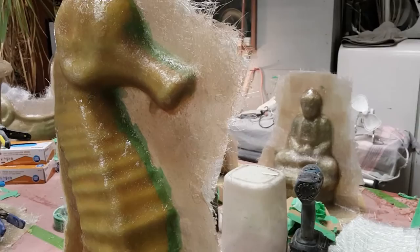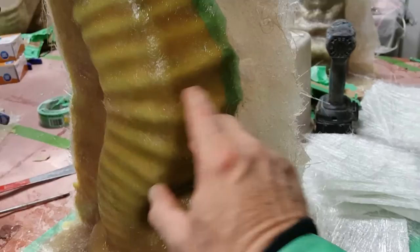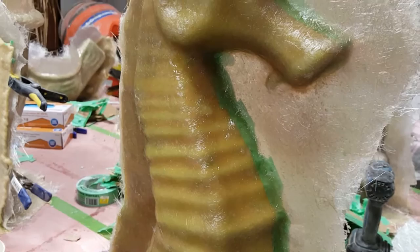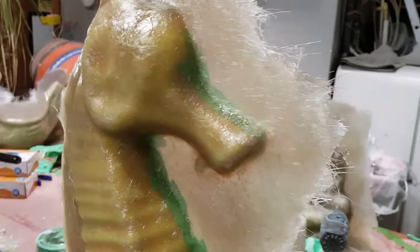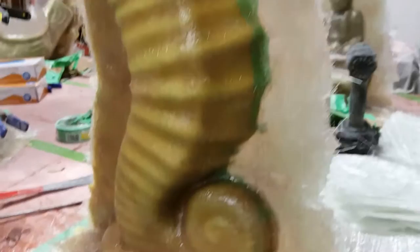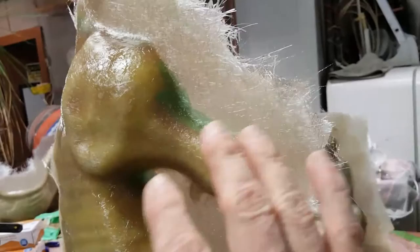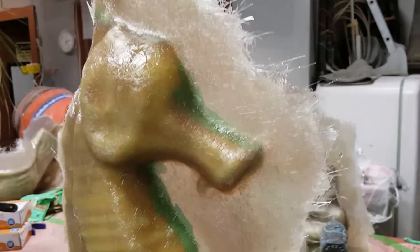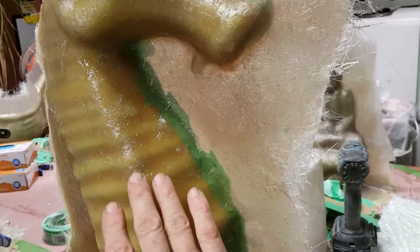If you're doing layers, you have to make sure you don't have any little hard pokey bits sticking out. If you leave that in between layers, it's going to be really hard and your next layer of resin won't melt around that, so you're going to have that pocket in there. It's a good idea sometimes to leave it overnight if it's a really big one, and give it a quick buff with your sander just to knock off all those little hard spots. You can alleviate that by taking your time when you put your last bit of resin on — go over it really good, make sure you've got nothing sticking up. If you do, just hit it with a sander quick to knock it down, because you will have a bubble right where that hard piece is sticking out.